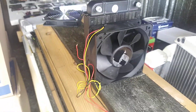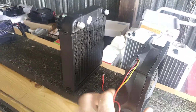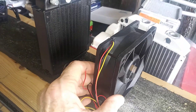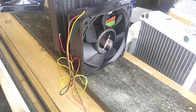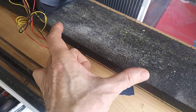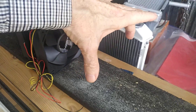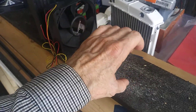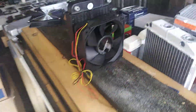I want to warn everybody: if you're trying to build this, first save your money. What you would want to do is separate it and put space between the fan and radiator. The fans I do use — inline fans — the fan is this thick but the cylinder it's in is this wide, so it's inline. With a PC fan, which is like a box fan, you could put tubing on the front to condense the diameter of the air. But if you just put it on like that, it just scatters — it's really not that effective.